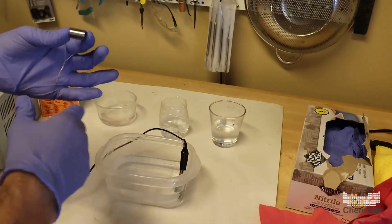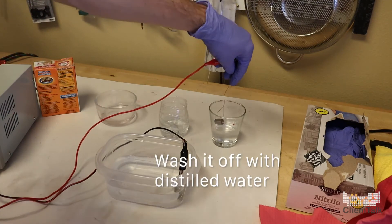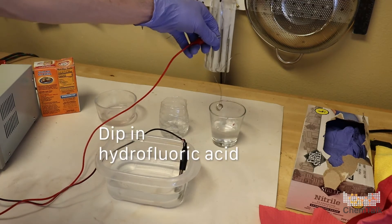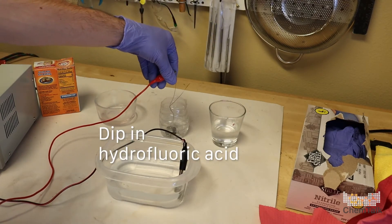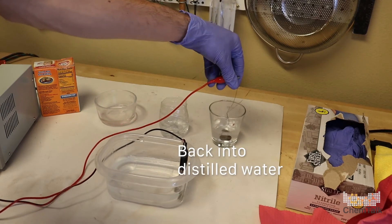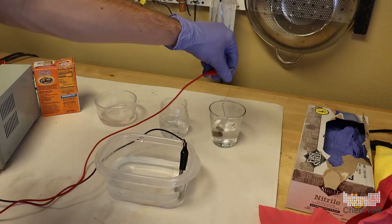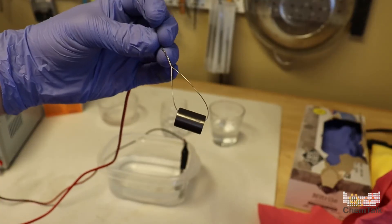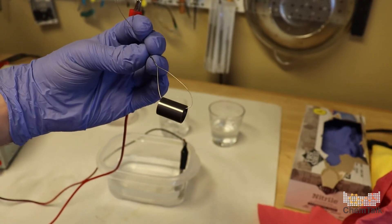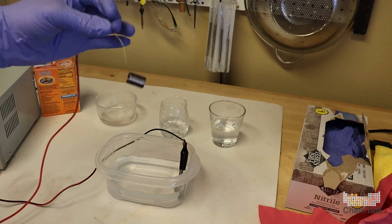All right, so that's probably pretty clean. Now let's clean the acetone off — I'm going to wash it off in our cup here, make sure all the acetone's off. Now dip it in the hydrofluoric acid for a second — you'll see bubbles start to rise. That's probably good right there. Back into your distilled water to rinse all the acid off. You can see the part is now duller in color because we just dipped it in acid. So now this part is ready to go into the anodization bath.